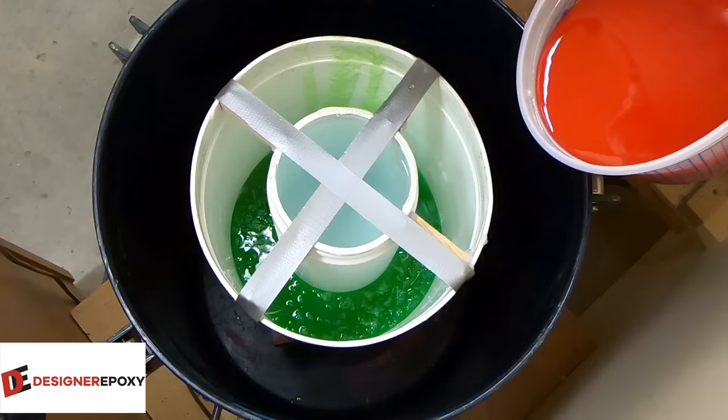So the water, I believe, was the effective thing here to keep this from thermal cracking. One thing that maybe I should have done was put a lid on the top of this loosely, not tight, but I couldn't find it, or else I would have. And the reason why I say to put it on loosely is just to allow the inside and the outside to get to the same pressure.